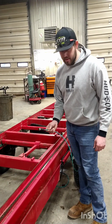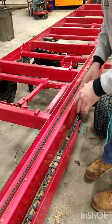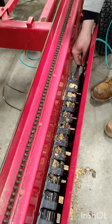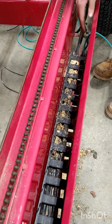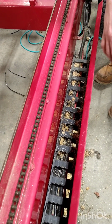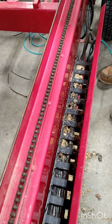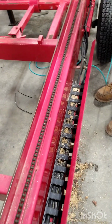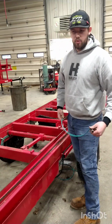Now that we've gotten our blue wire to the nylon track, on this particular nylon track, we're going to run it in between and fish it all the way up through. On the newer nylon track, you could pop out each clip and you could run it in between that way. And when you get it to the bend, you would clip them all back down, pull the head back, and then repeat the process. This is going to be the most time-consuming part, so take your time and do it the right way.